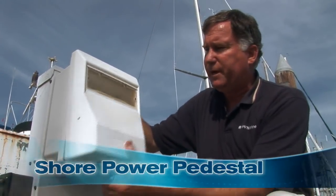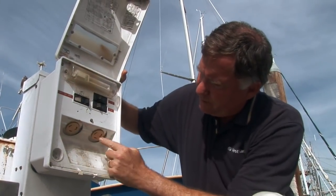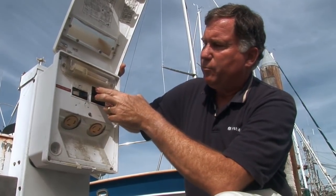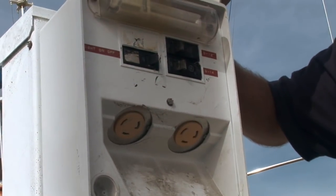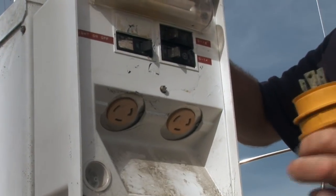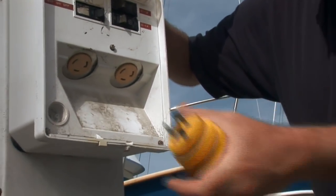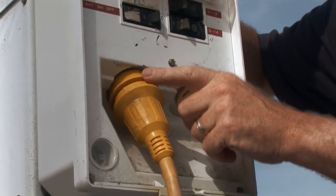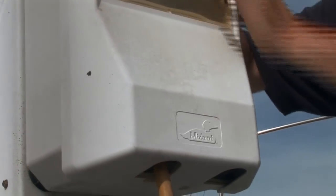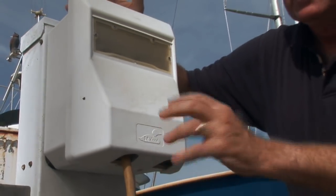John, let's start at the source and work our way to the vessel. This is a common shore power pedestal providing 30 amp service to two different slips, so it has two 30 amp outlets, with 30 amp breakers — both currently in the off position. The smaller breaker is just for the nightlight on the dock. We take one of the shore power connectors — it has a polarized plug that only fits in one way — put it in place and twist it. You don't need a sealing ring here because when you close the lid, it becomes a waterproof or water-shedding enclosure. So you don't actually use the sealing ring on the shore power outlet.